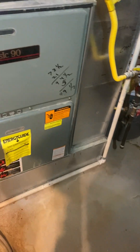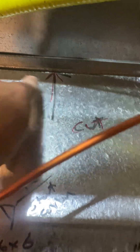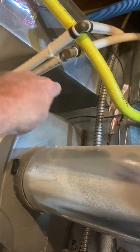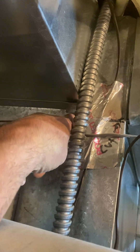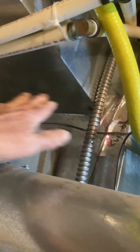We're replacing the AC with the heat pump and a couple miscellaneous things. The new furnace will sit on a base and the left side will be flat with the duct up here. The cut line is right here — I made the starting collar just to start the front duct. This side's going to be flat, and I made you a starting collar — just a triangle — so you know your cut lines at the duct in the front. This duct is just a tiny bit higher, so you may have to modify your transition a little bit for the duct.